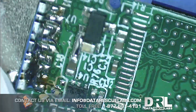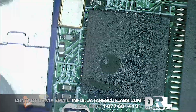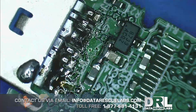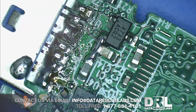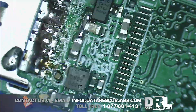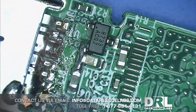Let's have a look at these USB thumb drives. This side looks okay — I don't see any problems here. The customer was trying to fix the USB header, and it's hard to see what you're doing without a microscope. There's quite a bit of solder here and they probably didn't use any flux, which is why the solder is all over the place. We've got a component here that's lifted, some solder blobs, but we can clean this up without needing to remove the header. This is a single-chip USB thumb drive, some off-brand.